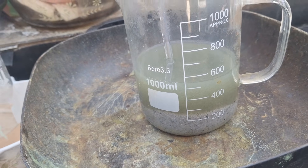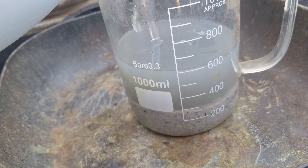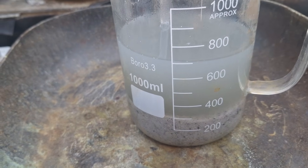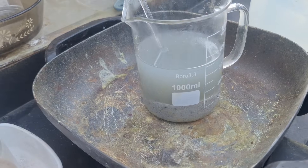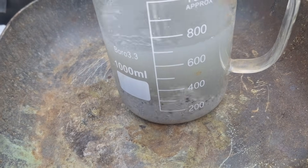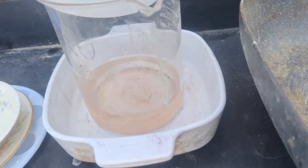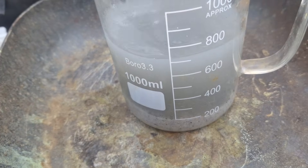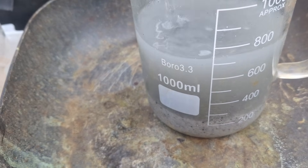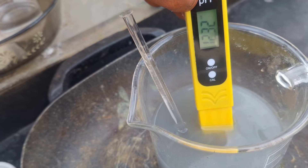We're at about a smidge over five on the volume — I'll go up to seven, just a little over 150 milliliters. That should be just about right. So now we've got our distilled water, sodium hydroxide to get it very basic, and bleach in there — that's the recipe. It worked before and gave us a tiny bit of gold, so we're sticking with the same game plan. Final pH check reads 12 — perfect.